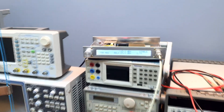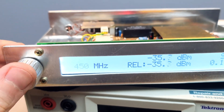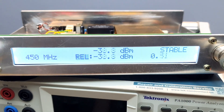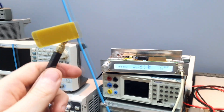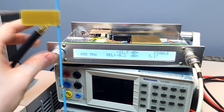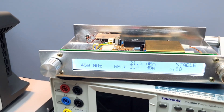I can change the position here. Actually we need to change to the correct frequency here, 450 MHz. We can enter here in the relative mode. So look at this, I will place the antenna here. Let me think here because I have only one hand. Okay, let's see — I will zero out the display here in relative mode and now I can change the position of the antenna and we see the relative power changing there.